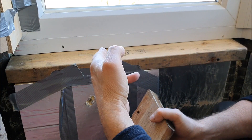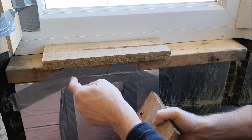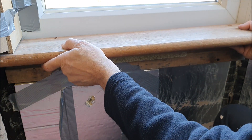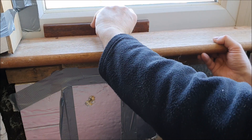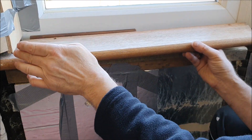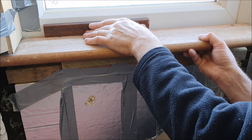So I'm going to use this as a framework which will fasten into the original stud, and then I'll probably get some packing or something a little bit better so I can fasten to the top of that and make sure it's the right width. This coincidentally happens to be the correct width for 18mm so the insulation can go on there. When I do finally come to put the sill on I'm at the height that I want it. I'd like to bring the sill forward a bit — I would like the sill to go past this piece rather than that piece going past the sill. So I'm going to put an extra piece on the back when the wood yard is open again.